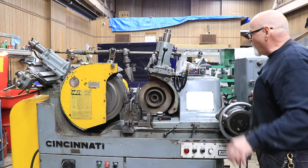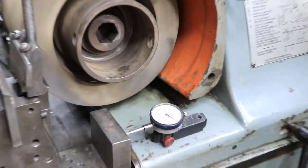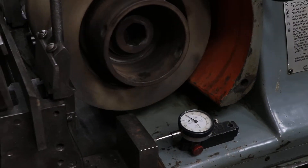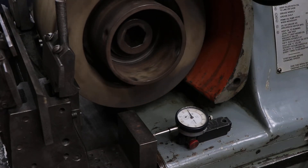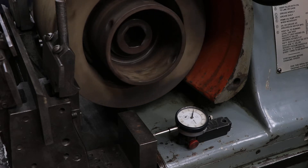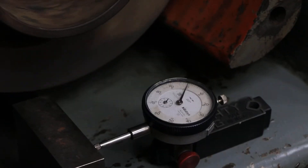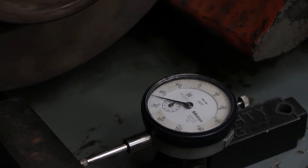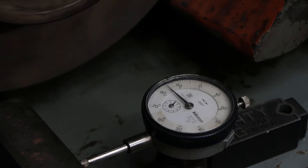I'm going to show you — if you move the camera in here a little bit — I've got this crude setup here with the indicator. When I press the start button, we're going to rapid it in to a certain point which you set. That's your stock removal, and then we're going to feed. The feed rate can be adjusted by the knobs on this in-feed box, as well as the point where the fast feed stops and the fine or grinding feed begins. It's going to go down to zero and sit there for a little bit until spark out, and then the whole thing goes back again. Any fine adjustments, if your part's not the right size, get adjusted with the main hand wheel of the grinder.